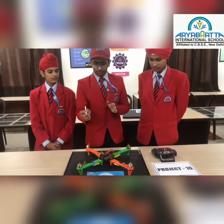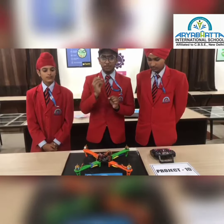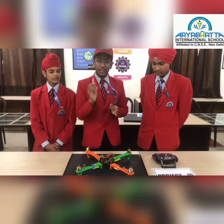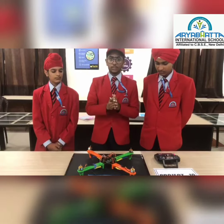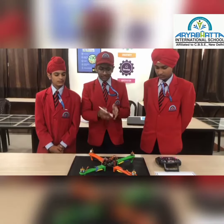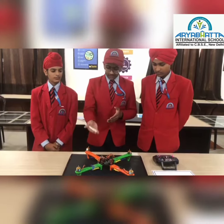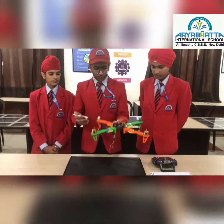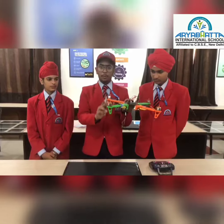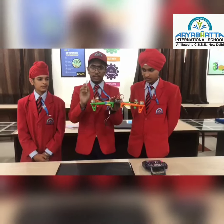Just take an example. If one of the propellers is hit by a gust of wind, the user would have a split second decision to balance the motor, which is beyond human response time. That's where the flight controller comes to the rescue. The flight controller is like a mini pilot that sits inside your drone and makes any changes that a human can't. For example, in this situation, the gust of wind hits this propeller and the flight controller would give direction to the ESC to speed it up or down and balance it.